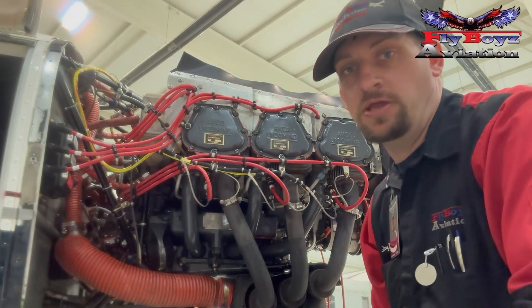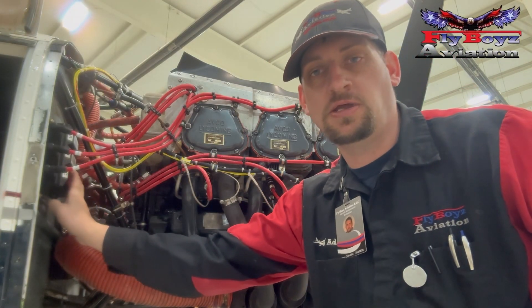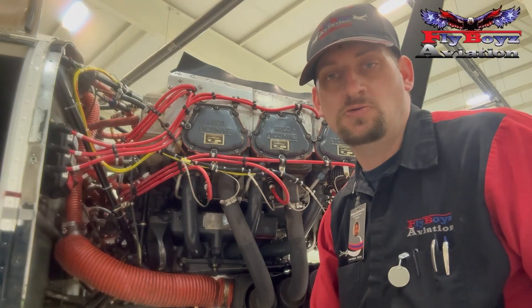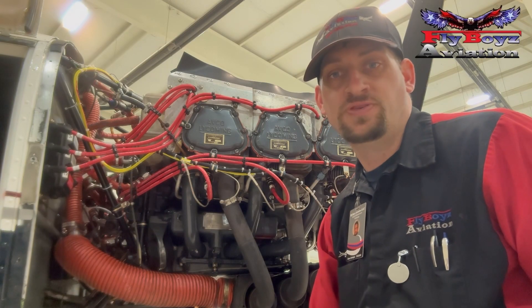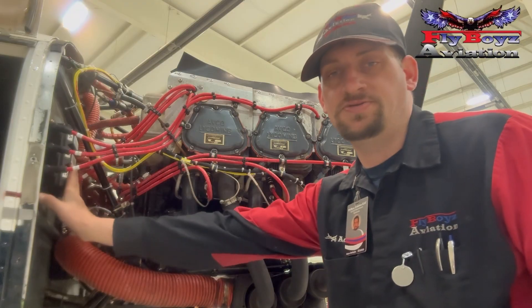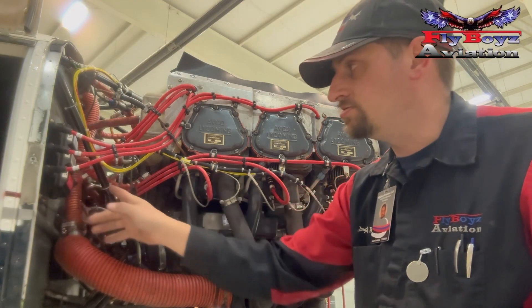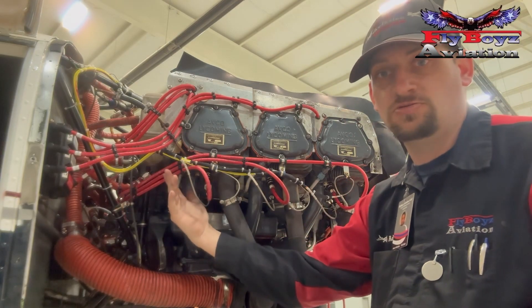As far as the routing, typically I've got one coil that I designate as upper leads and the other coil I designate as the lower leads. I always designate number one — the one being powered strictly off the aircraft — as the bottom leads. The one coming off of the backup battery I designate as the upper leads. This one here I have designated as number two, doing all of the upper leads. The coil on the other side is designated as number one doing all of the lower leads.